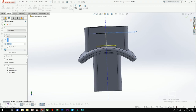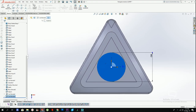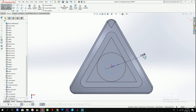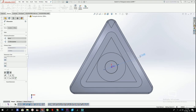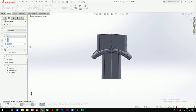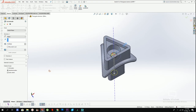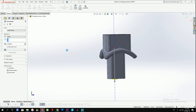My radius is 4.09 — that's great because I needed a radius of 4, a diameter of 8, to put the screw head in. I'll offset by 1.5 and cut out by 2.5 millimeters so my cap doesn't touch the bottom. Now let's see how long the screw needs to be — 3.7 millimeters for the screw to go all the way through, and it requires about 18 millimeters total. So I'm going to need an M3 times 25, which I don't have — I'm going to need to buy them.